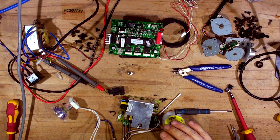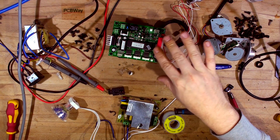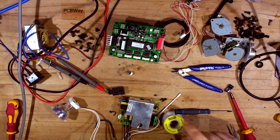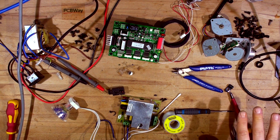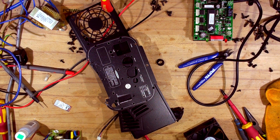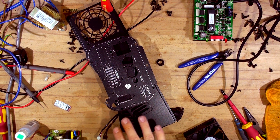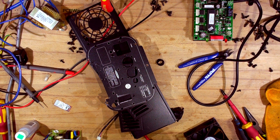I'm going to clean the board, replace those two rusted LEDs, check all the dust, probably put a better enclosed fuse in there, and replace a few caps here and there just to ensure everything is good. I've already put the glass optics in the ultrasonic cleaner. I decided against sandblasting and repainting since that would remove all the writing, so I used a rust converter instead — you can see the white stuff where the rust has been converted. That's a lot better than having rust itself.